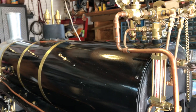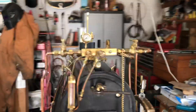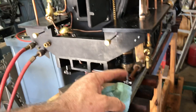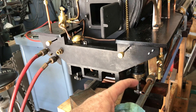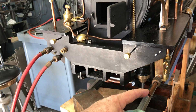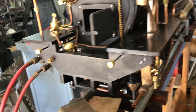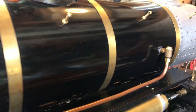We used the little fill device I showed before and just used that one tank full of water. The injector start valve works fine — that's the part I was worried about. But I didn't have a way of metering the water flow for the test. I have something on the tender for that, so next time I need to either have it hooked up to the tender to meter the water flow, or make a little inline valve. The injector seemed to work, but water was not going into the boiler.